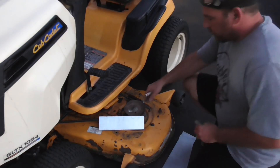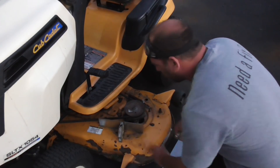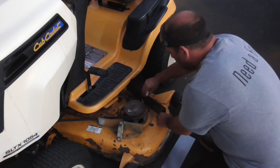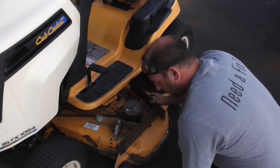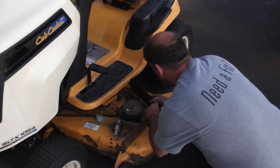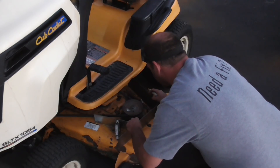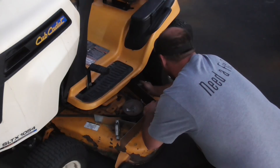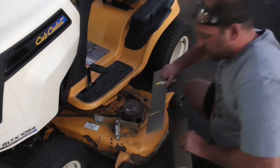The plan is to be kind of quick and crude here - doesn't have to be perfect. That's a welding magnet, 90 degree. This metal is a little bit higher and there's kind of a curve down here, so when I go across like this they're actually pretty close to level - within an eighth of an inch. That should be good as long as this thing reaches. So I'll back this one up a hair, cut that one off, and make those cuts.